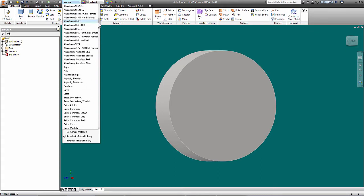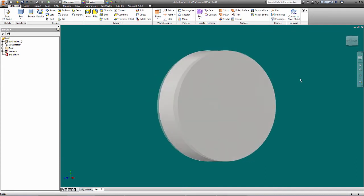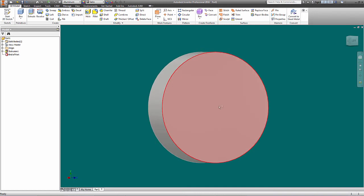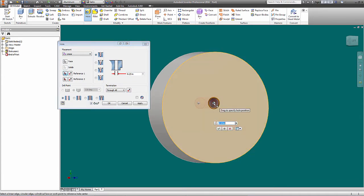Let's go to the material library and see what we've got for aluminum — we're going to be playing with cast aluminum, old crappy aluminum I have lying around. Let's just call it aluminum. Now we want to shape this to do its hubly thing, so I want to throw a hole in there. We're going to have it press-fit onto the shaft, so on that face the hole is going to be a press fit — let's say 0.493.